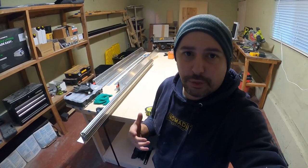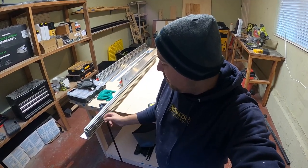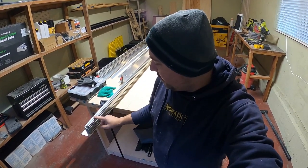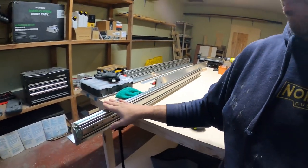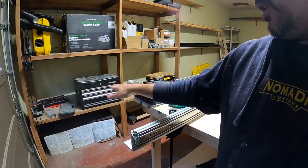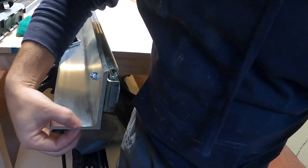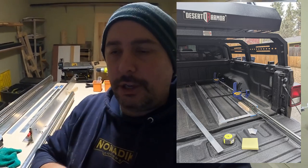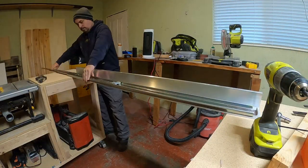But I got a 1x3 80-20. And the 1x3 80-20 is going to attach itself right to here, 3 inches up. So it's going to clear this as the point. Once it clears that, I can actually put another piece of 80-20 across that. The dimensions have to be spot on because this 3-inch lip right here sits in between the ribs of the Jeep. And that's where it's flat, and it's all good.